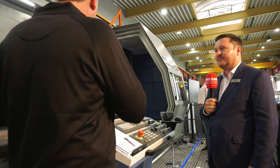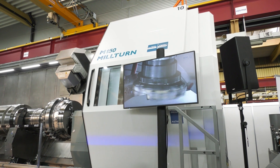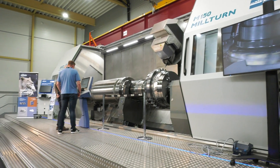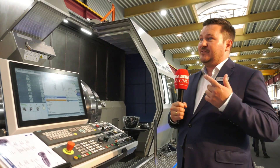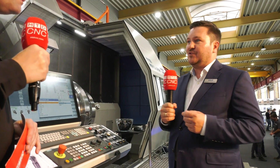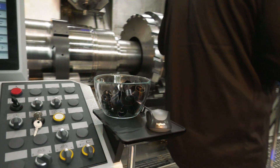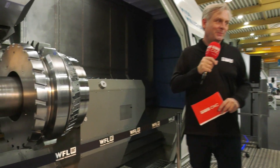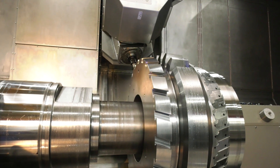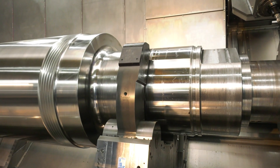So you're doing five-axis machining — it's not just milling or turning; there are a number of different applications. Milling and turning is our bread and butter, but since our philosophy is 'clamp once, machine complete,' we have to incorporate a large number of other technologies — like drilling, deep hole drilling, and all types of gear machining. And it's difficult materials too? This is typically where WFL shines — whenever it comes to difficult-to-machine materials, whether it's very hard steel alloys, titaniums, or Inconel — that's really where we can use the strength of our machine.